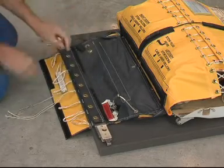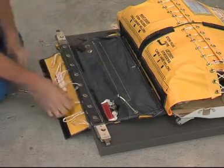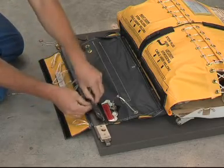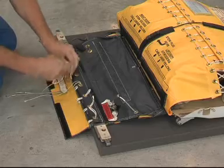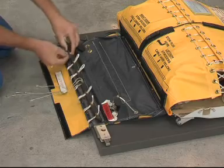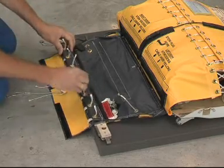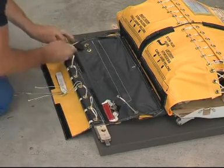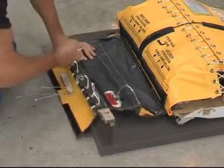Make sure that the visual indicator faces inboard and forward. Pull the cord loops through the grommets in the short girt flap. Start at each edge of the girt assembly and pull the cord loops through each other to the small cord loop at the center.